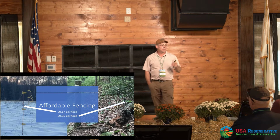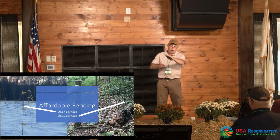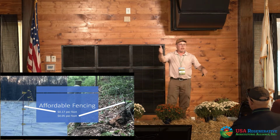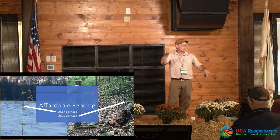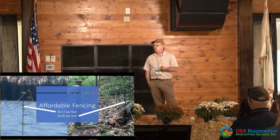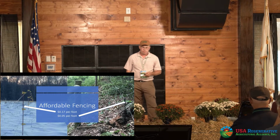And that's putting the end posts in, putting a brace on it. On the end post, I'm putting a guy wire down. I'm putting an earth anchor in, and then I'm connecting. I'm using a T-post on the ends of those, because what makes a good fence? Good ends and good corners. That's what makes a good fence.